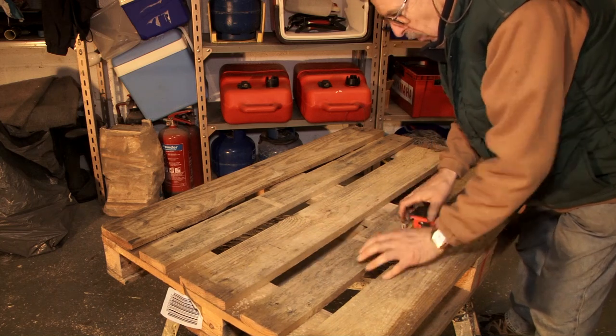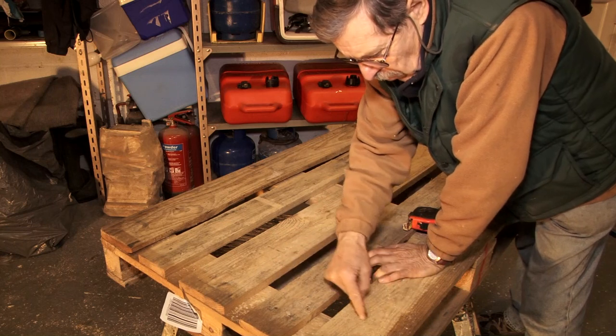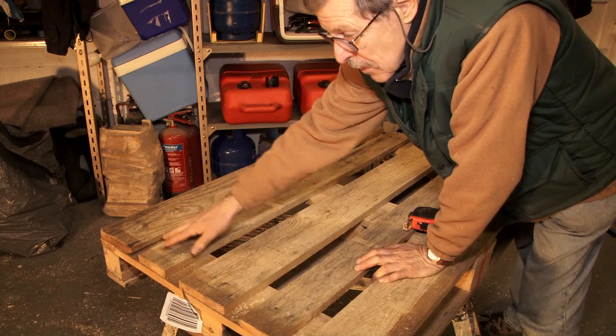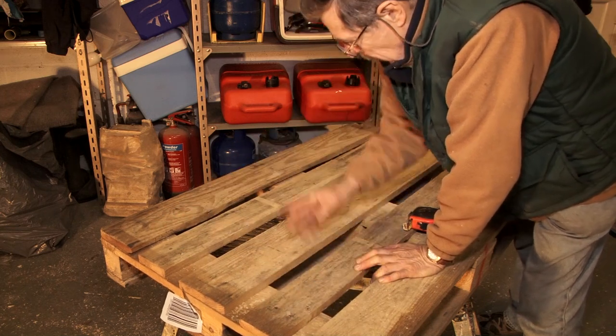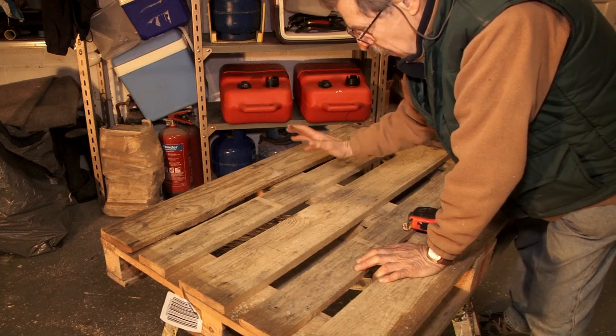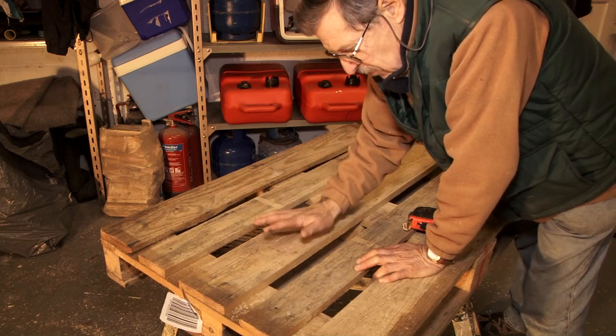feet long. So what I'm going to do, I'm going to run the saw, using a long bladed reciprocating saw, along the edge of the band here, right where it butts up against the support. That saves me cutting all those nails, splitting all these nails out. I get a nice straight cut, same the other end, and I'll get the lever underneath here. I can lever it up and hopefully get the minimal damage to the wood because this is then ready for sanding down.